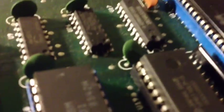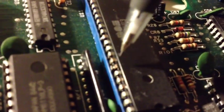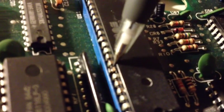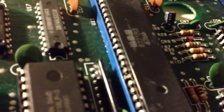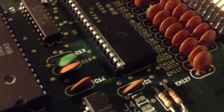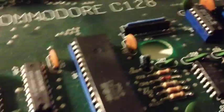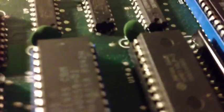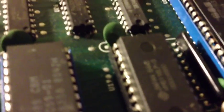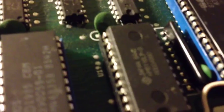Especially over here — there's one particular pin that looks as if it's been split and then put back together with a bit of solder or something. The chip has been removed. In fact, I think a lot of these chips have actually been removed from this board and sockets put in place, because there are two different colours of sockets — some are black and some are blue. I suspect this machine has been worked on before, although the person I bought it from told me he's never opened it up, which I'm not entirely sure is true.